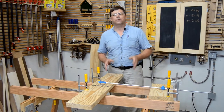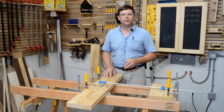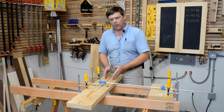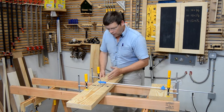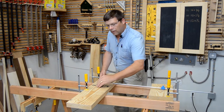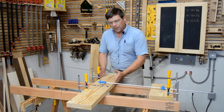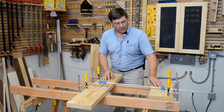Now, there are a couple of different ways we can go about bending these strips into the wood pieces that we need. I prefer to make a two-part mold. I'm going to cut this piece of 2x8 material along the arc that I want the part to end up at, and then be able to use both sides to clamp the parts together. I've got a Trammel set up.